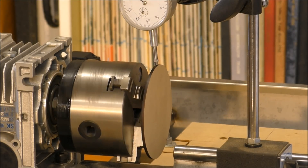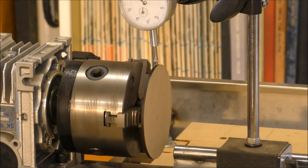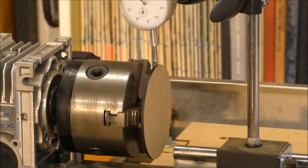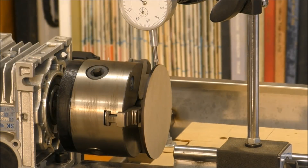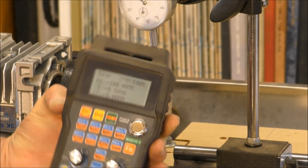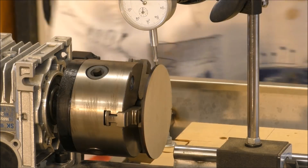What I'm doing at the moment is making sure that it will actually go the full 400 millimeters, which it is doing. So one full revolution is approximately 300 millimeters — coming up to 400, so it's one and a third. It's also showing me on my hand controller that it is in fact operating to within less than a thousandth of an inch. So I'm very happy about that.